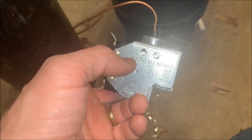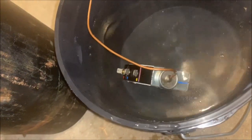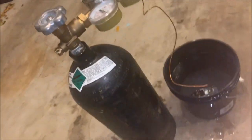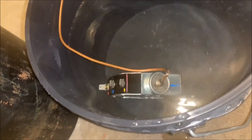My only rationale was that the reason the oil was there is that at low pressure when it was running, it was causing a leak, and at standing pressure it was high enough that it was sealing the leak. Right now I've got 100 psi on it and I was noticing no bubbles, so I'm going to back this off. There's not going to be a leak right now — I'm going to have to bleed the pressure off. Look at there — bubbles. Low pressure is leaking.